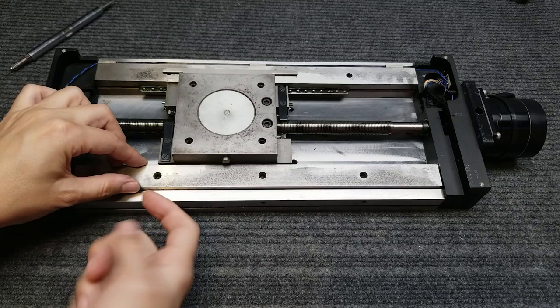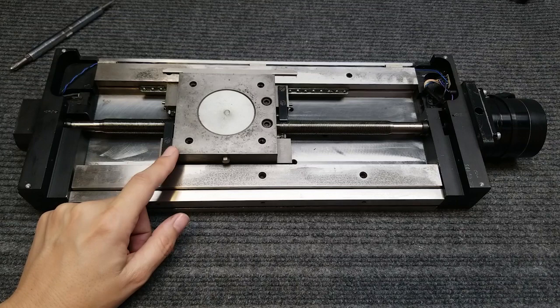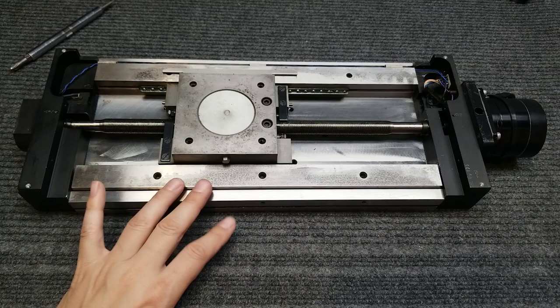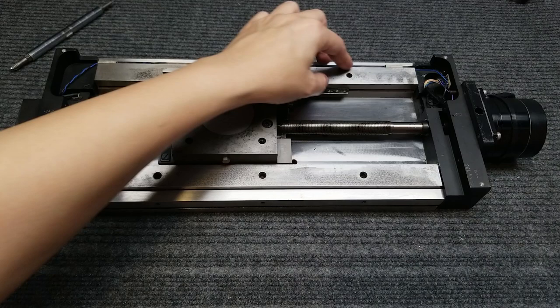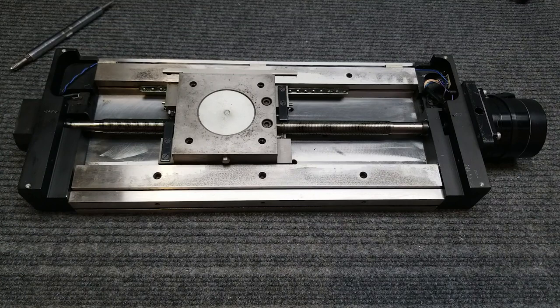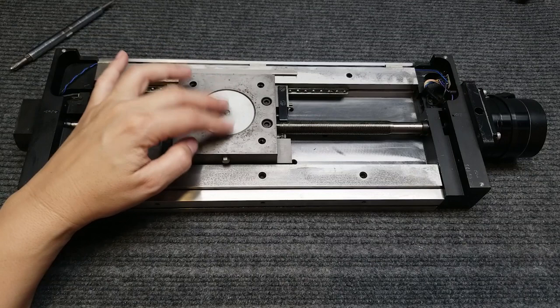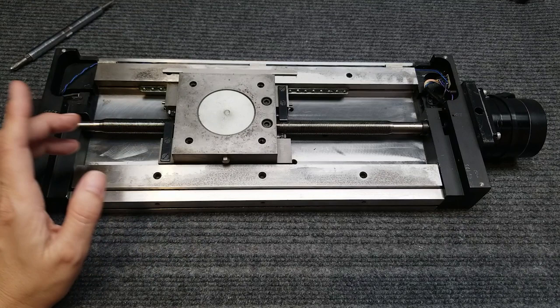They had made a system to keep this oiled - there was a pot of oil right here with a little fill plug. This plug is just pressed in from the top, and that would keep it lubricated. This is the lead screw, and it's cut to one millimeter pitch. Originally, this thing has a one-millimeter lead screw and originally it had a 200-step motor on it. I think it was a Superior Electric, made in Bristol, Connecticut - where I used to live.